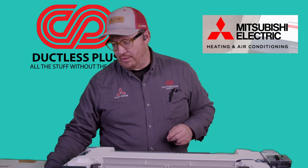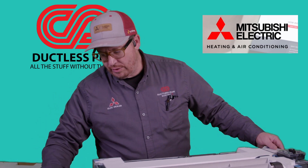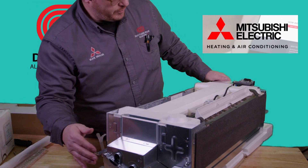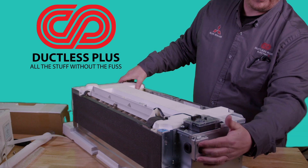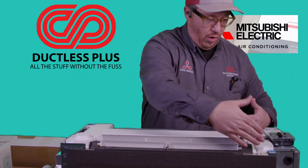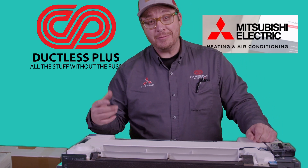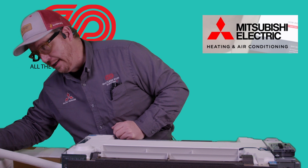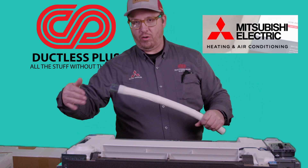That's basically the head itself. If you look over here, it's just like the other ones. This is your entry point for your refrigeration piping — it simply comes out on this side. This is your control section where you're going to install your communication cable. Look at how small this guy is — it is absolutely very cute. The drain line is going to be going in over here, tying into there. What I like about these drains is they're flexible — you hook them up, you run them up, and when we run our bridges across, we strap that to that.